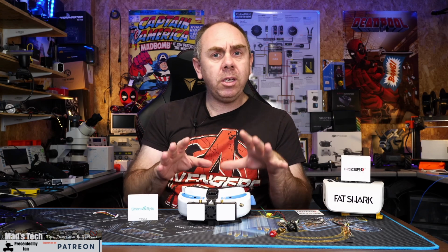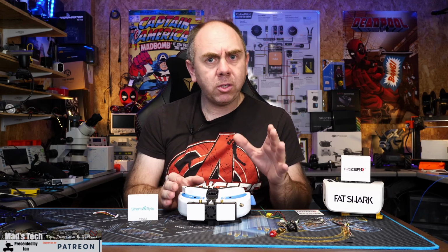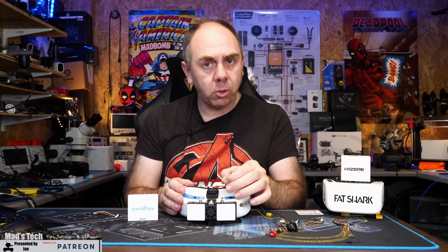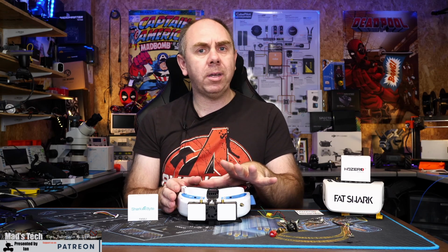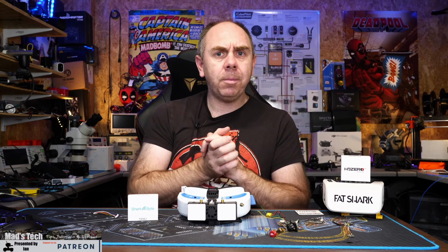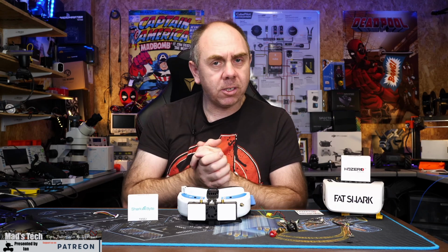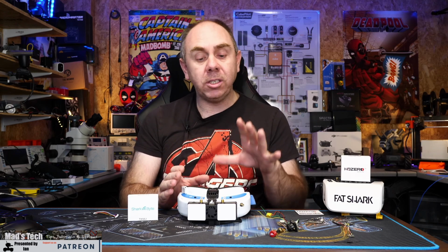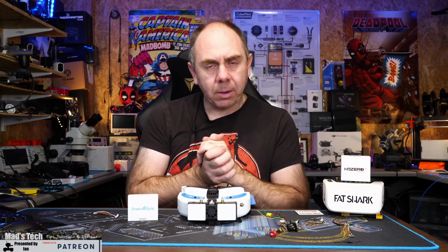One other thing I just wanted to mention before we move forward into actually doing the process is you need to also be aware of the formatting of the SD card you're using. My advice would be to format your SD card in your goggles module before actually using it. That way you know it's been formatted correctly and you shouldn't have any problems. I have seen some issues with formatted cards in the range of FAT32 and some with exFAT as well, so the best way is to format them in the module. That way it should go through without a hiccup.